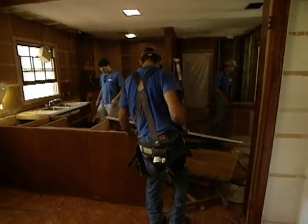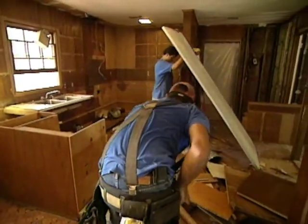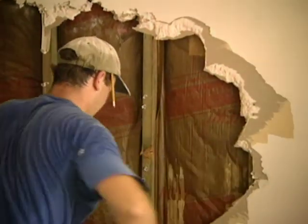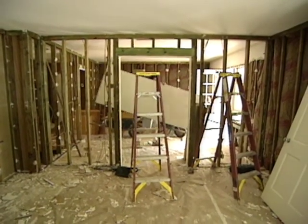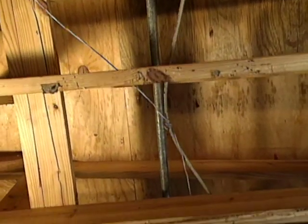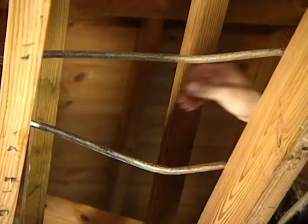On the inside, we were able to remove many of the kitchen cabinets that were in place, but because they were built in place, very few were able to be salvaged. Then many of the walls and ceilings were removed because so much framing has to take place — all of the framework needed to be exposed. Now that the framing has been exposed, it's revealed a number of electrical and plumbing lines that'll have to be relocated to allow room for the recessed ceiling. We found a one-inch galvanized gas line right in the attic space over this room — it'll have to be raised up a bit. A number of electrical lines will also have to be relocated or terminated, but a few have enough play to lift up the 16 inches necessary to rest in the new attic space.